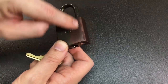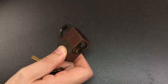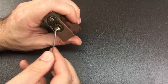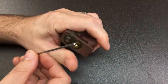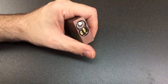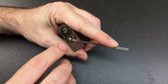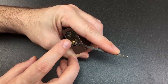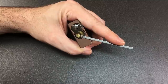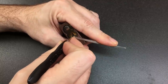I saw there's a Phillips head screw in there so we can disassemble this later if we're lucky, and I have my pinning tray to hand. For tensioning - I could go top of the keyway, or try some bottom of the keyway stuff if I've got the right tensioner. I'm going to try something like a Southord Max 07B. Let's have a feel around - yeah, that feels comfortable. Good tension on.